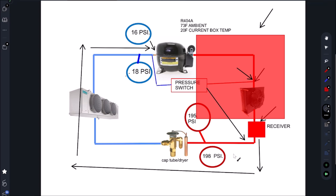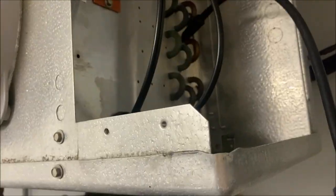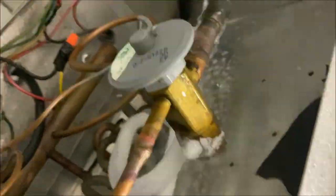We're going to have to recover all the refrigerant — we have no choice. The active leak is on the low-pressure capillary, but if you look at the high-pressure one you can see almost an indentation — that's going to leak eventually too. This pressure switch looks pretty new, but whoever changed it didn't separate the capillary tubes, allowing a rub-out to occur. We're also going to be thorough and complete our leak test on the coil — and we do not have a leak there. We open up the entire system and charge it.